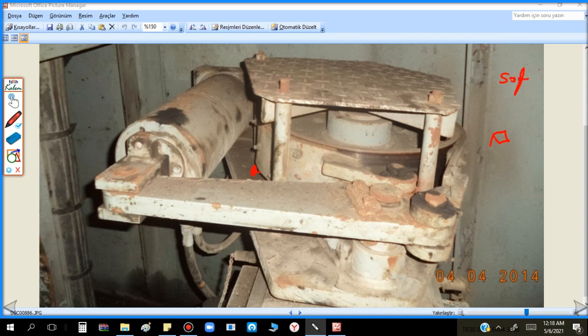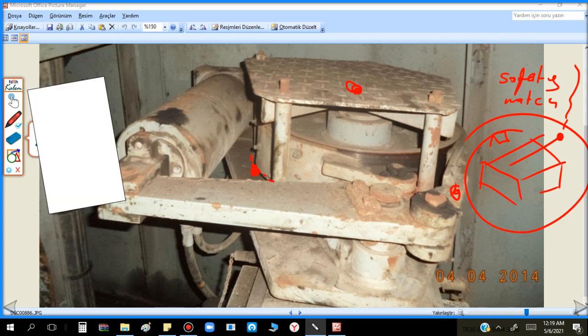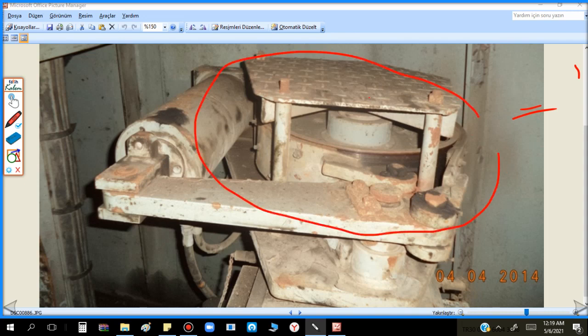Some very small cubic plates - you could say like a safety match box. They weld these here, maybe three pieces: one here, one here, and one maybe in the aft, but it is in the down area. When you walk on deck you will hear some mechanical voices, metal to metal contact - a 'gurch gurch' sound but much more sharp, metal hitting metal. If your cranes are IHI cranes, this voice is coming from here.